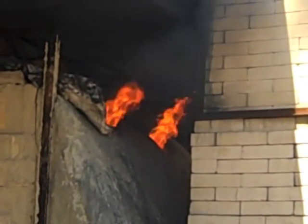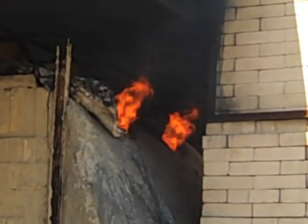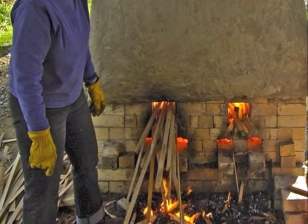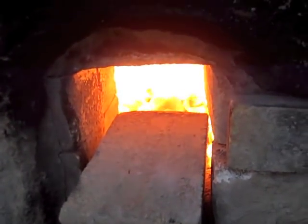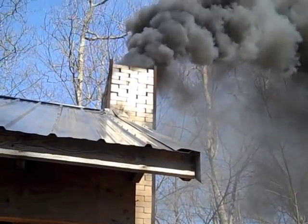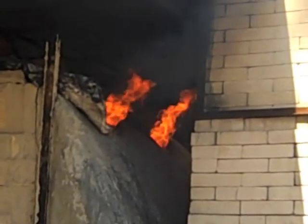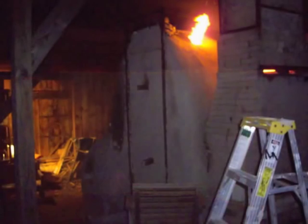This wood fire kiln belongs to Allison Palmer of the United States. It reaches its desired temperature between cone 10 and 11 in approximately 30 hours. Here you see the firebox, which is on the side of the kiln. The wood is stoked here until the kiln reaches temperature. At that time, this area is bricked up and side stoking commences. After side stoking, the kiln crew watches the chimney — black smoke means the kiln is in reduction. When the smoke clears and the fire holes on top of the kiln recede, it is time for another stoke. This pattern is repeated until the kiln reaches its desired temperature, then held or soaked for approximately one hour and the firing is complete.